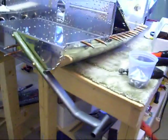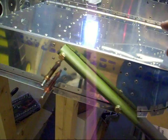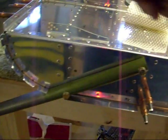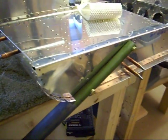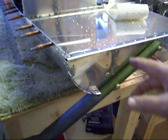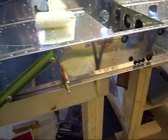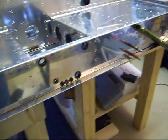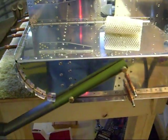Back to the front. There are two angle irons — one here, one here — came in one piece. There's two more over here, also came in one piece, and you have to cut them into four pieces. Then you have to fabricate them to a certain extent and make one of them smaller. Then you have to match hole drill them, mount nut plates to the angle irons. They suggest that you prime them, which I did. I also primed the step — that portion of the step that will be inside the fuselage.